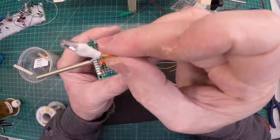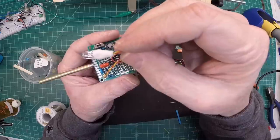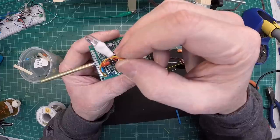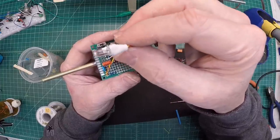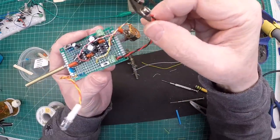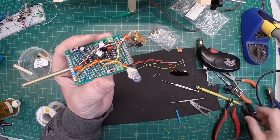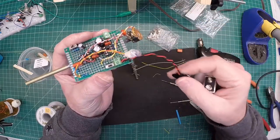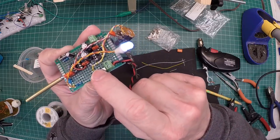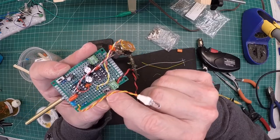Let's get the LED dressed up next. You can see I've got the LED dressed up — I used the coil method on my lead wiring, then soldered those on with a couple pieces of heat shrink boot over each conductor, then two pieces back over the total bundle. That cleaned up nice. I also soldered up my 9V battery lead. Let's put a battery in — I don't have the ICs in yet — just to make sure we get a light on the LED. Flip the switch and there's the LED lighting, so that's a good sign.